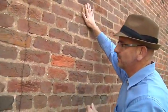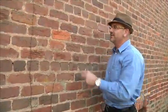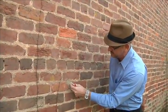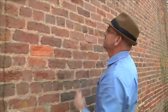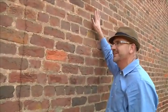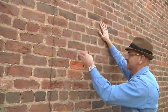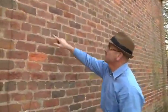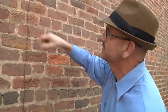These are going to hold up pretty well, but once it's sealed — and this is not a one-time deal, this has to be done about every seven years — we are going to repair all the bad mortar and brick, replace and get rid of all this modern Portland cement mortar that's damaging the building. Then once that's done, we reseal it with the amber-tinted linseed oil — the aroma is incredible after you've done it. Then you come back with your four-foot level, draw the horizontal lines, and hand-strike the verticals. The reason I know the verticals are hand-done is you get up close and study them — you can see they're not all perfect. They draw the horizontal joints and then come back and draw in the vertical lines with their pencil.